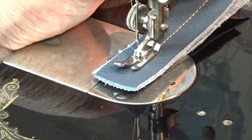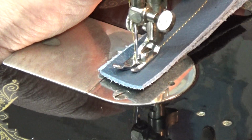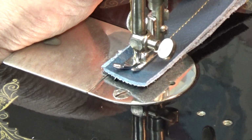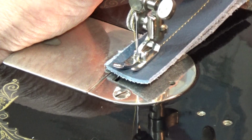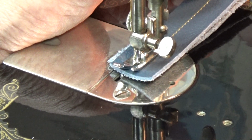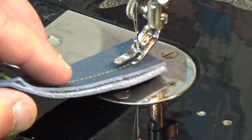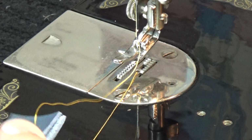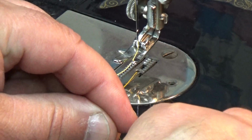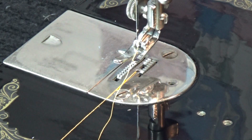Yeah, they do. I'm glistening right now as I'm cranking off these final stitches to finish this protected full-grain leather. Last stitch. Jiminy crickets! I like our lock stitch, but it's a little bit weak. I didn't have the upper tension quite high enough for 2 layers.